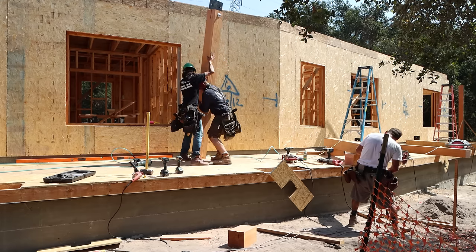So you have a truss here, you have a truss here, you'll have an H-clip in the center to help support that span. The reason we don't have to use them is because we're using 5/8 sheathing. When you use half inch sheathing, you have to use H-clips as well. So by us using 5/8, which is a little bit thicker, an eighth, we can bypass using H-clips. So that's what we've done out here. Not to mention we've been doing 5/8 roof sheathing for years now. Bypass those H-clips, make things a little bit easier.